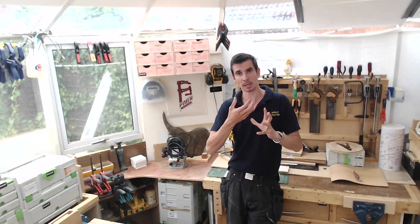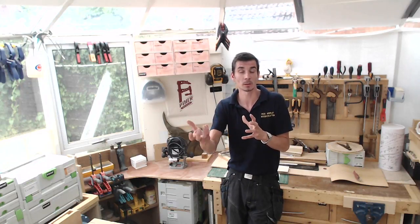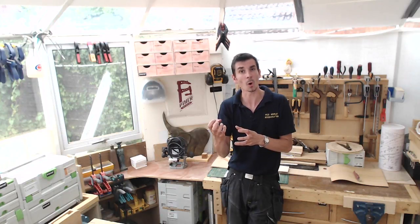The other thing to bear in mind is that the cutter coming round is taking its cut, churning out wood — that swarf, or chips, whatever you want to call them, need time to leave. The faster you spin, the less time that swarf has to disappear, and if you increase it to the point where it can't clear the swarf but it's taking more and more timber, then you get what's known as chatter. You may have come across this with smaller cutters in deep pockets, where you get a much coarser whine because you're basically cutting against all the chippings and it's all packing in.